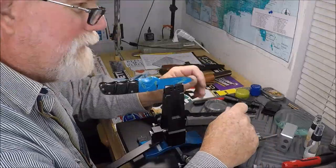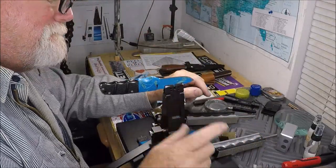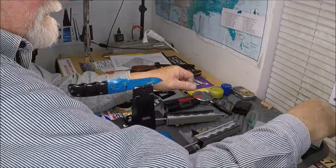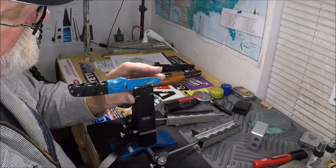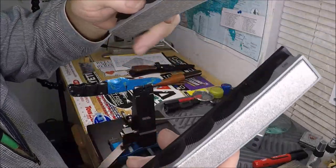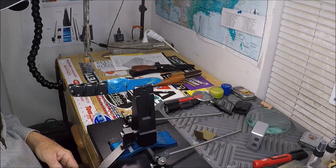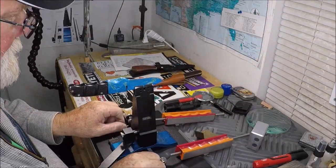Got to work on it some more. I don't want a blade that I'm working on skipping, because that's what it's going to do. I think we finally got that chip out of there. That took a little while. Believe it or not, this thing wasn't even close to sharp — and it's sharper now than it was after running the 50 and 80 grit diamond stones on it. It looks like we're going to go through pretty much the whole gamut here. It's got a nice burr. Tighten everything up, because it has a way of loosening up. I'm going to recheck my angle.